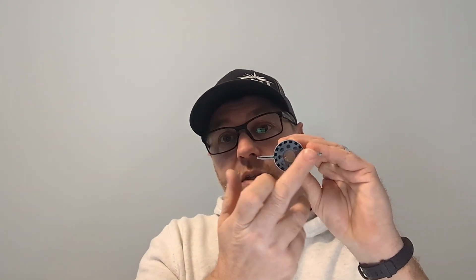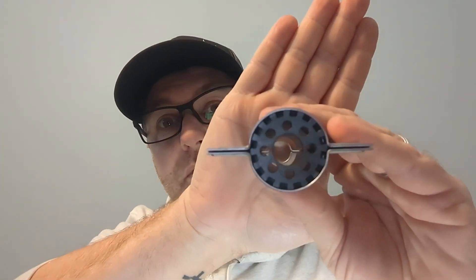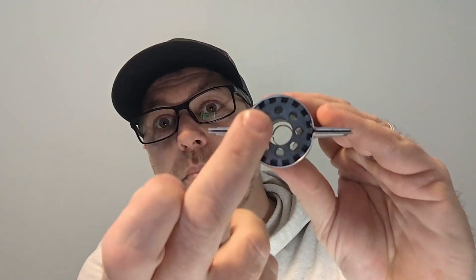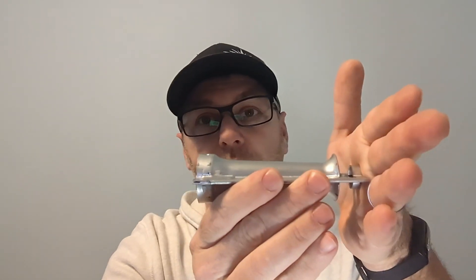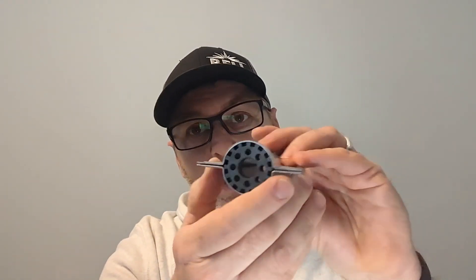These things love to get surface rust on them. You get surface rust on there because that burner sits in there. You've got an orifice that sits in the end that's on your gas manifold as it connects to your gas valve. The gas valve opens, brings gas through the manifold, puts it through the orifice. The orifice restricts how much gas is allowed to enter that burner. Then as that goes through there and the fire burns, it's actually drawing oxygen in for combustion air.